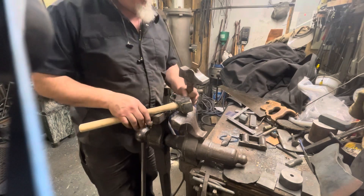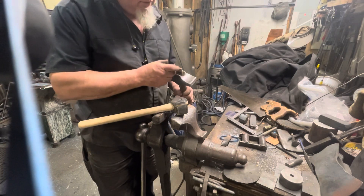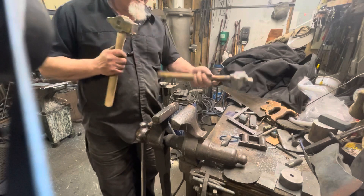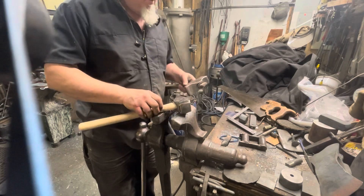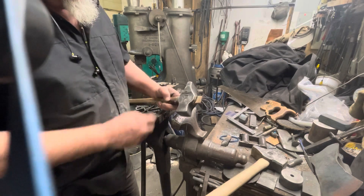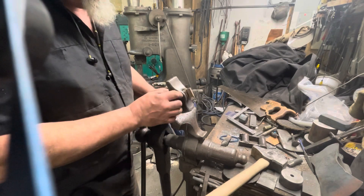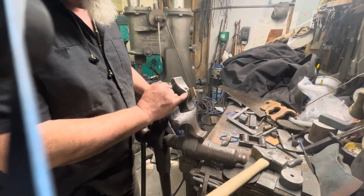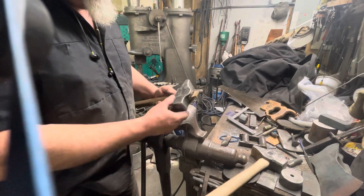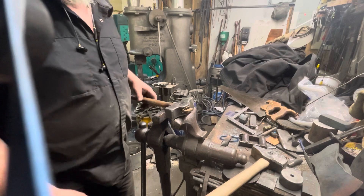I haven't quite reached my mark yet but I've encountered solid resistance, so I'm sure it's filled the void. And there — I should be able to get a few more years out of that. I'll give it a quick sanding for any rough spots and cut my wedge off. I like the wood to slightly exceed the final height of the hammer — it acts as a cleat. And that's how I get another few years out of a good hammer handle. Thanks for watching.